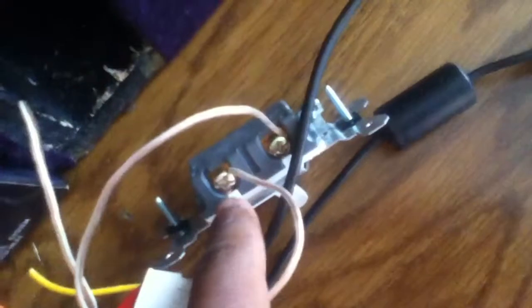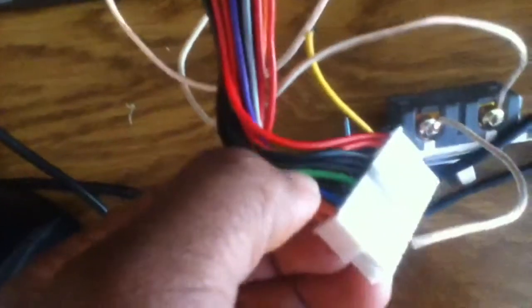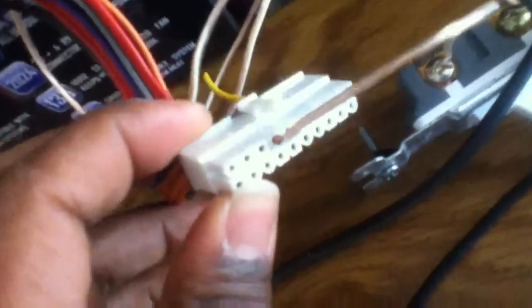And I put one lead to the switch. This is a regular light switch. They say only use these for alternating current house wire. I don't even know why they say to do that, AC only, but I use direct current, DC, and it seems to work fine. So like I said, the green wire has to bridge into the black. It has to connect. When you take a paper clip or something like that, that's what we used to do back in the old days.